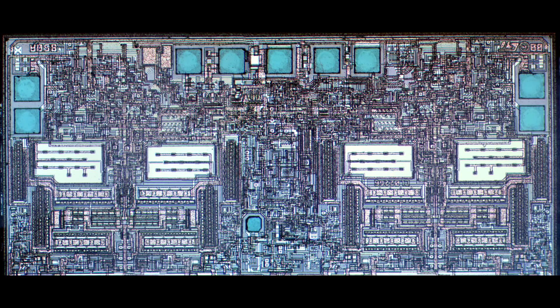So, much as I expected, a very attractive looking die. Dual pads — that's an unusual feature. The high wattage here required them to put two bond wires per function, so that's why you see in that structure the rectangle with two circles in it. That's where the bond wires had landed.